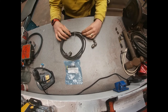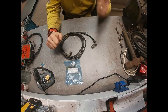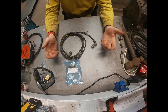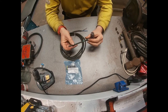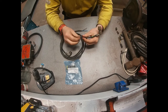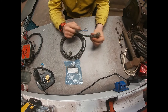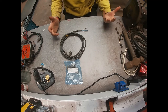We have here a two-pin cable normally used for connecting up a Clansman intercom system in a vehicle. It has a male end and a female end. What we've done is cut the cable, and always cut the cable with a little bit of spare on each end — that means if you need a short cable you can make that up, and it's a handy tip to give yourself about six inches of spare so you can reuse the cable. This is a nice long cable so we have the option of where to place our boiling vessel.